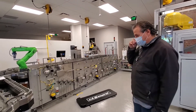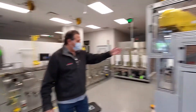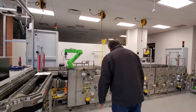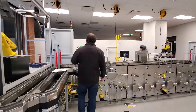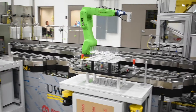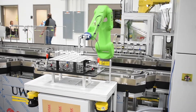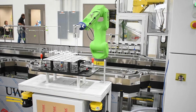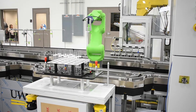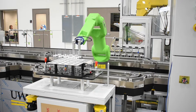Because of the potential hazards here, the Delta robot will sit here — it's currently right here but hasn't been put in place yet. That's the dry fill. The collaborative robot is this green LR Mate with sensors in the base. It also travels on a seventh axis rail. So it's an educational opportunity to understand the differences between what can be used for collaborative use and what can't, because while the robot is traveling on the rail, it cannot be considered collaborative. Once it stops, it can be considered collaborative, and that logic has to be built in.